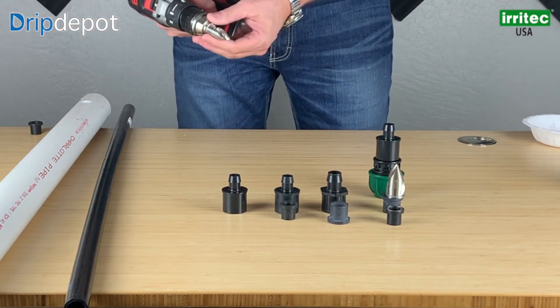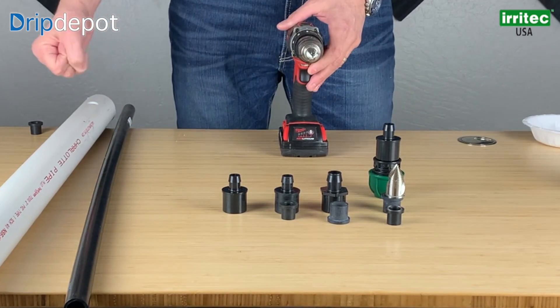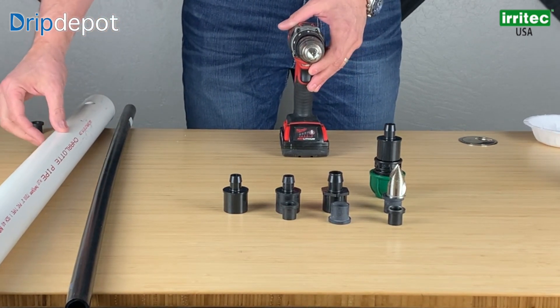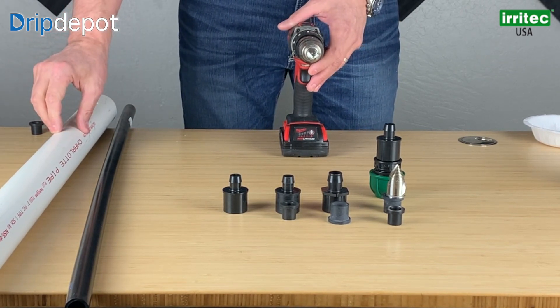When you're drilling out on your PVC, know that the thicker the schedule of your PVC, the more you're going to have to press the grommet in. A class 125 PVC will flex a little bit, which makes it easier to pop the grommet in. A schedule 40 PVC being thicker will make you muscle the grommet in a little bit more.